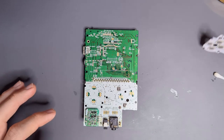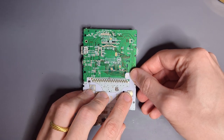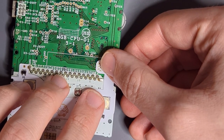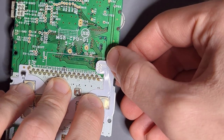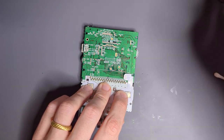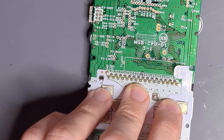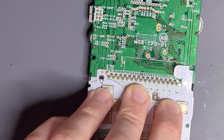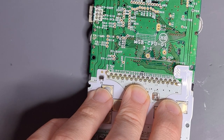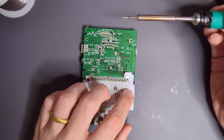What we're going to do is lay the flex board over and try to find our alignment. This is going to be a little bit tricky — you need to make sure you have pretty good lighting. First, let's go ahead and tack down the ground pin over here just to get this board anchored in place. This isn't actually electrically required because these are not common ground boards, so ground isn't really a crucial factor here — it's simply a mechanical thing. Let's get a little flux on there, get a little bit of solder beaded up on the iron, come in, and tin that pad.